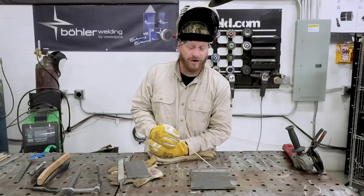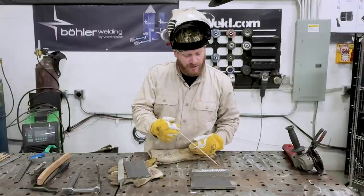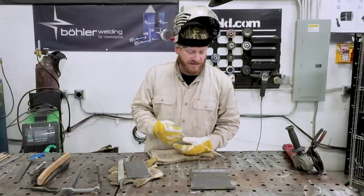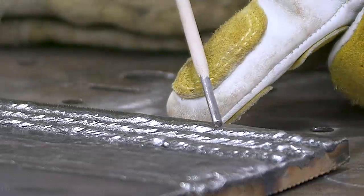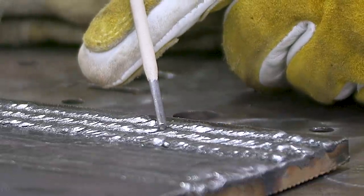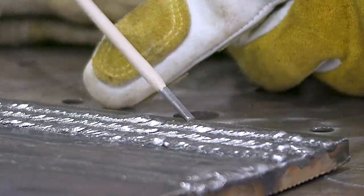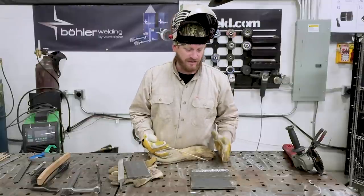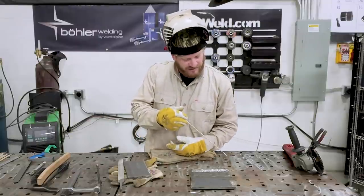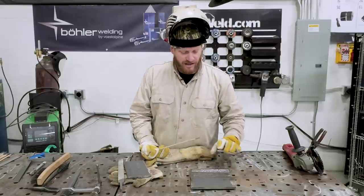Because this is focused on practicing and trying to keep up a steady stream, I kept running. But in the real world, these little impurities right here are gonna cause you to fail a test or could also compromise your welds in the future. However, the main focus is practice. So I stayed steady with the rod after I snuffed out. I just kept going to clear out.